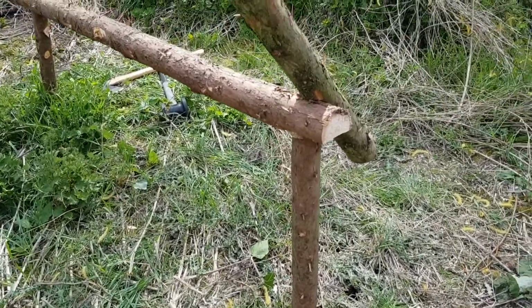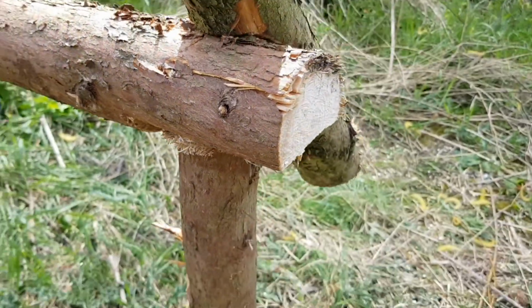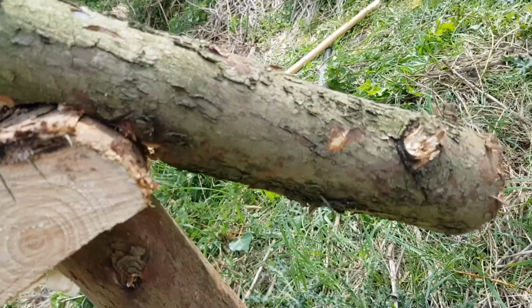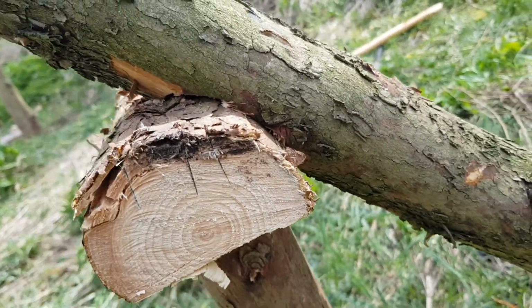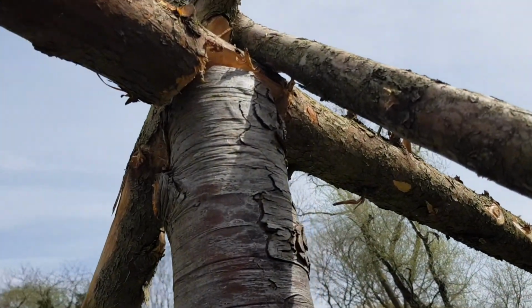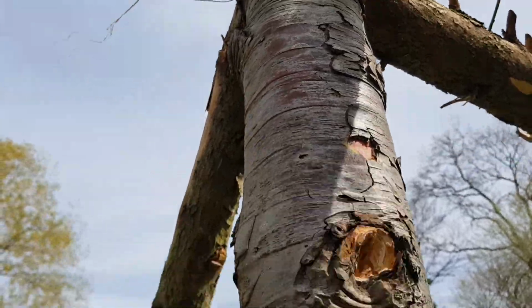Then on the side walls, we've cut notches just to sit the post flat on them, and then the roof ridge poles, as you can see, we've taken a notch out in the shape of the wall just to lock on. We've done the same up on the roof. Everything has just got a little notch out of it, so it sits in there.